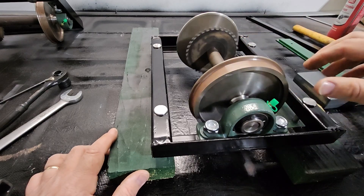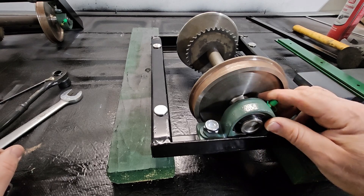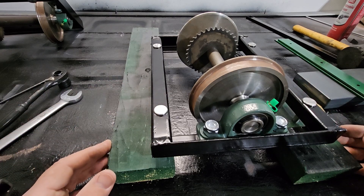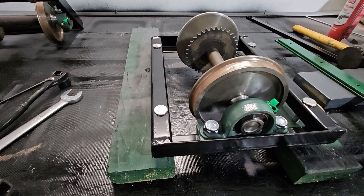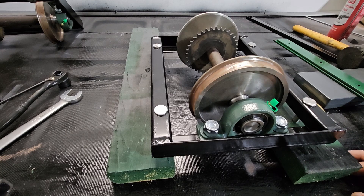You can get them just about anywhere, which is why I use them on these. It's much heavier duty than what you need in this application, but over-building a little bit builds reliability, and I like reliability. This also makes it easier for the user to repair — you just go down to the farm store, get a pillow block bearing for a three-quarter inch shaft, pull the old one off, and put the new one on. An infinite part source, you might say — well, maybe not infinite, but they're around. There are many different grades, so you can upgrade them too.